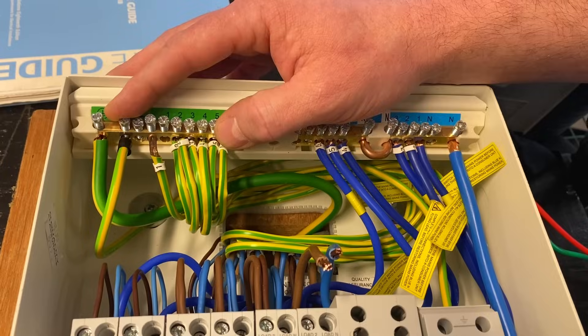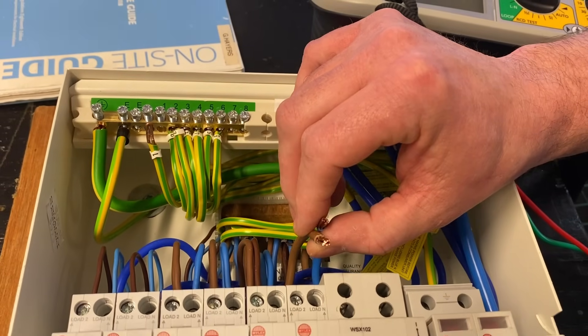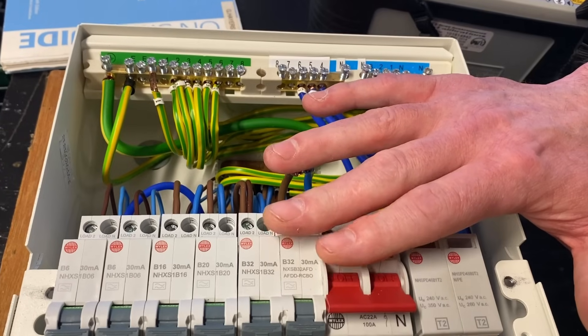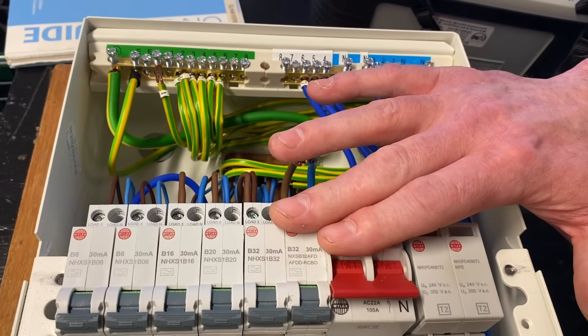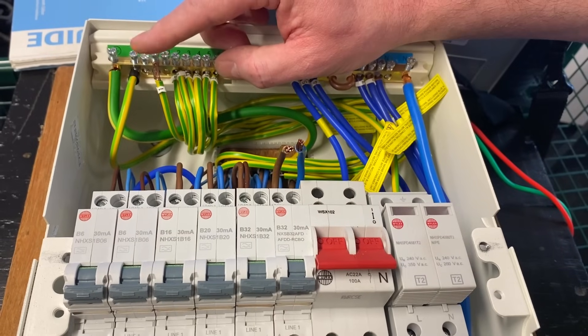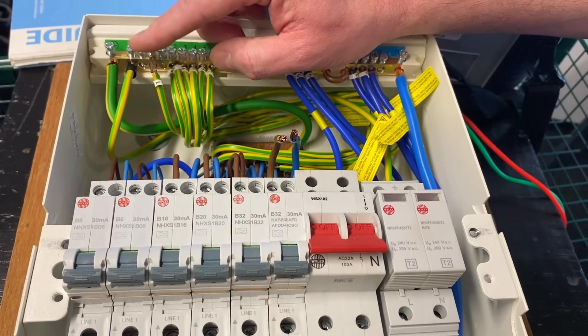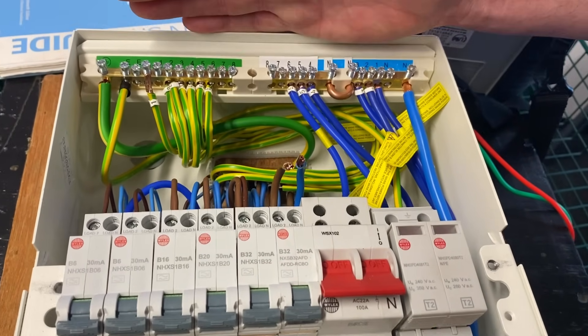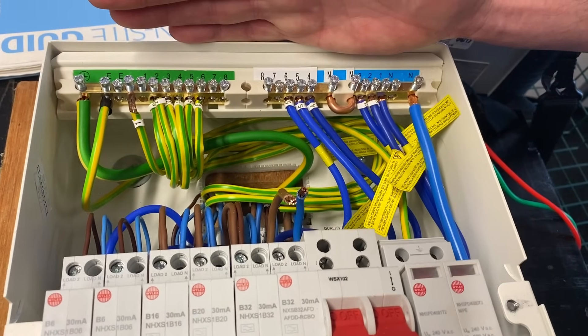There's no protective bonding in here to gas and water, but it could be that this earthing conductor goes down to an MET and the MET has more bonding in place. So I must connect this conductor to the earth bar — which is connected to the source earth — as well as any protective bonding before carrying out my insulation resistance test. I can then carry out the test with the live conductors disconnected, removing anything I'm worried about such as SPDs, AFDDs, RCBOs — but it's vitally important that the CPC conductor is in place and connected to the earth source. Let's see what that is said in BS 7671's on-site guide.